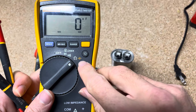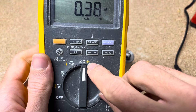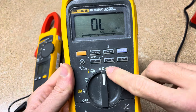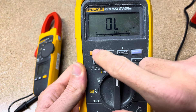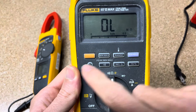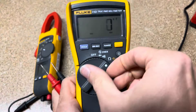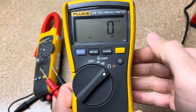This same symbol here in yellow, and then this same symbol in here in yellow. On some of the Fluke multimeters it might be in white and you don't have to use the function key. But for all of these we're going to have to turn the dial to where we see the capacitance, and then we're going to have to also hit the function key. Right now I'm in resistance so I have ohms over here — the moment I hit this function key it then goes to microfarads. Same with this: you would turn to it and it turns to microfarads. Now we're good to go.